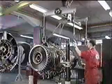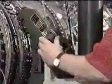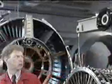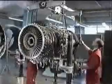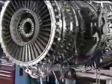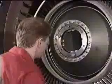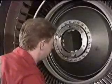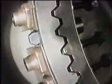So, refit the sling, alter the center of gravity, lift the module and clear the support out of the way. Align the module center line and gently bring the modules together. Final module alignment can be achieved by viewing down the fan stub shaft. Ensure that all the location dowels in the curvic and in the flange locate into their related holes in the HP system module.